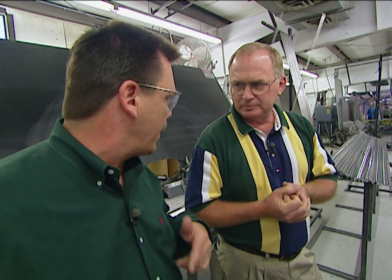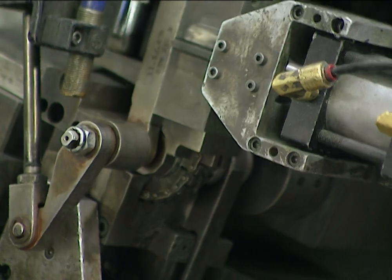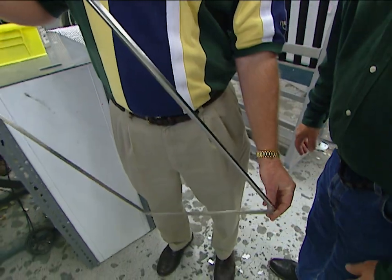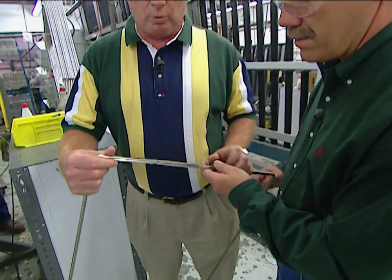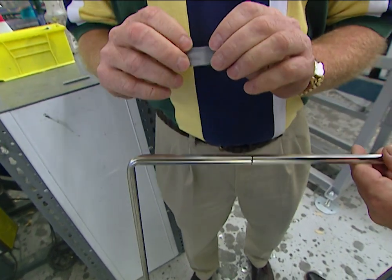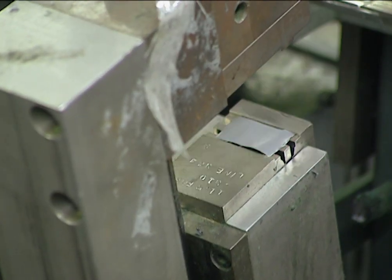In cold climates you can get ice forming around the edge spacer in some windows. Stainless steel is less conductive, and you never have to worry about it corroding. To ensure longevity, the spacer must be sealed entirely around its perimeter. Bending the spacer enables a complete inorganic seal around the entire perimeter, including the corners, against gas transfer or moisture vapor transfer. One joint is sealed with a connector and butyl tape backed by aluminum foil, since moisture vapor and gas cannot transfer through the foil.